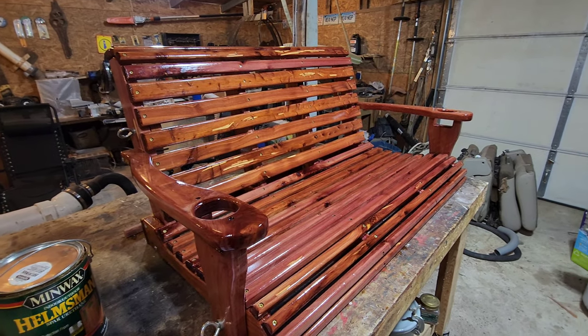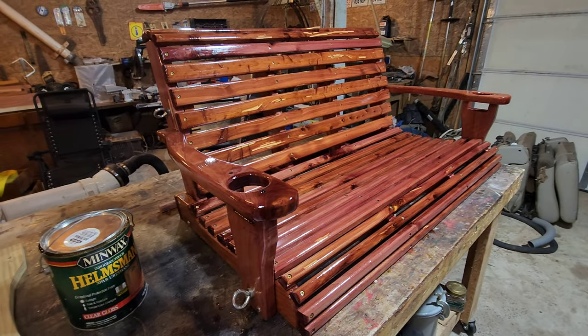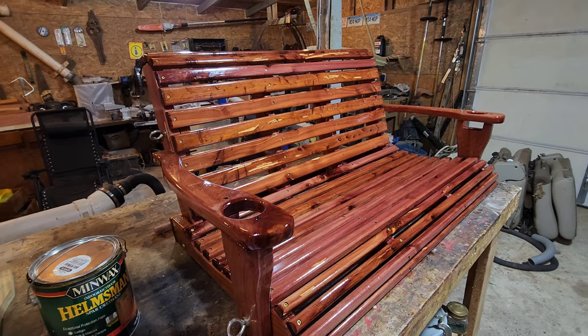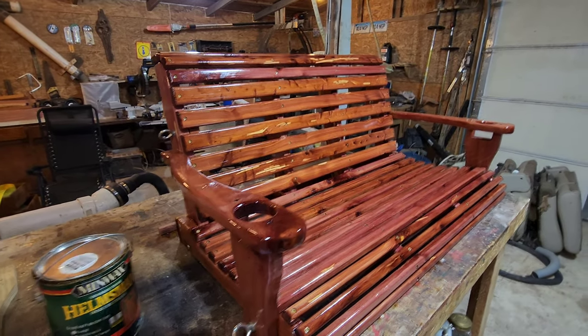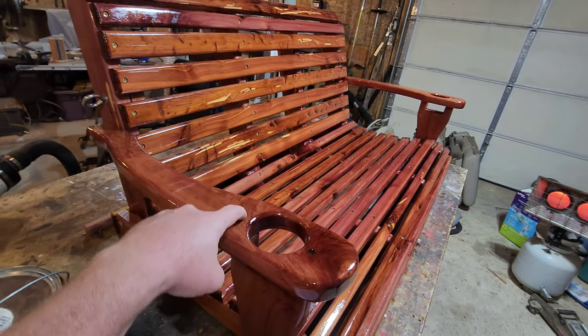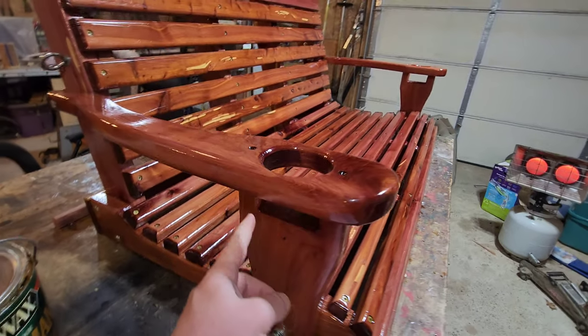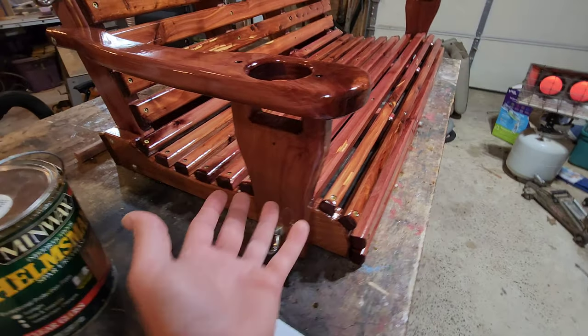14 1/4 inch by 4 inch carriage bolts with nuts, washers, and lock washers. I used 108 2.5-inch Saber Drive all-weather screws. I used 4 3.25 Saber Drive screws down into the armrest, because this is 1.5 inches thick. You want to be able to reach down into here good, whether you're doing the cup holder or a regular upright.